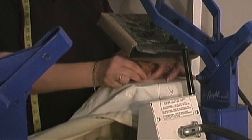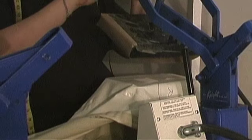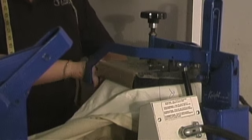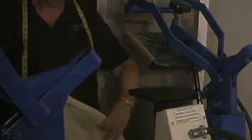We recommend at least 1-inch length of seam tape. Place the moisture barrier on the seam sealer film side up. Center the tape over your marking and engage the machine according to manufacturer's directions. After the repair is complete, test for leakage.